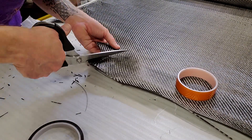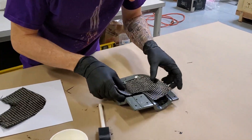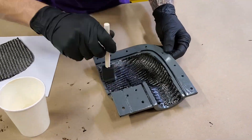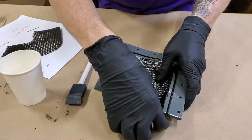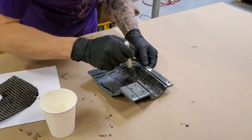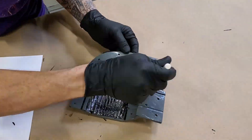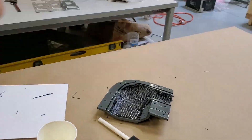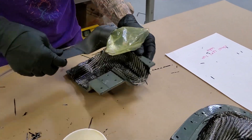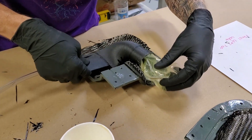Now it's time to painstakingly cut out a whole bunch of carbon fiber, and then again painstakingly go through basically the exact same layup process as the first part. Then it's time to insert the core — this is pretty much the same as the first part, except now we have the internal bladder, the internal vacuum bag, sticking out of the top.